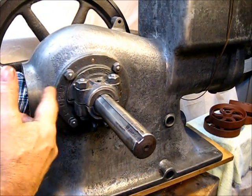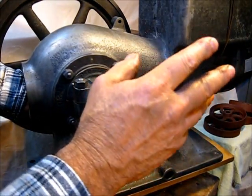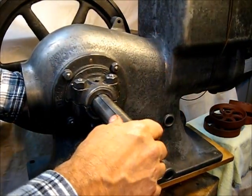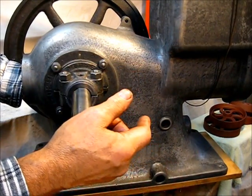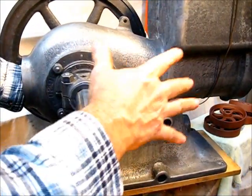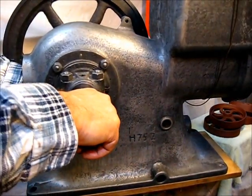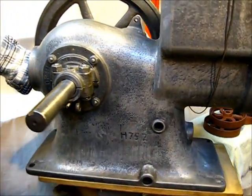The thumbs on the top, the two fingers are on the bottom to keep the shims from rotating. You do not want to get one of the shims halfway around so it locks up on your crank throw. I know just describing it like that it sounds haphazard, but if you were actually doing it, you would understand.